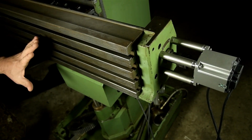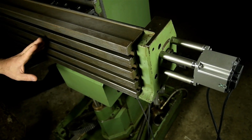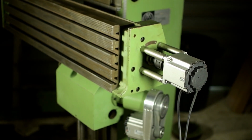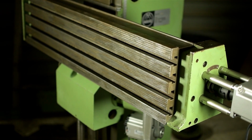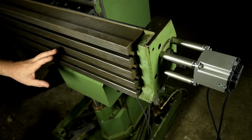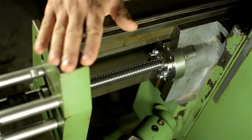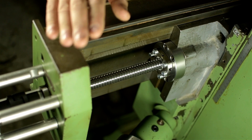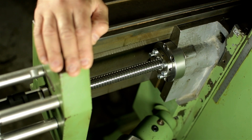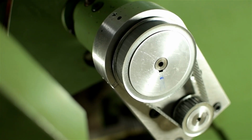All right, Houston, we have X-axis. Before we even get started, can we stop a minute and listen to that beautiful sound? I've actually recorded this and now use it to get to sleep at night, instead of my usual 10 CD collection of whale song. That is the soul-cleansing sound of ball screws pushing cast iron on decadently lubricated dovetail ways. In comparison, let's hear that Acme screw on the Z-axis one more time.